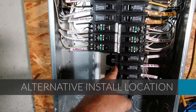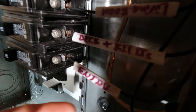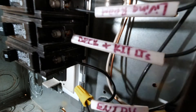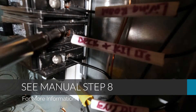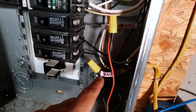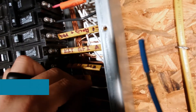If you need to, this is an example of an empty location in your breaker panel where you can install new breakers to power the sensor. In my panel, I decided to go with the recommended method to use two existing breakers. To do this, I had to remove the existing wiring from the breaker and add in that additional piece of wiring, then connect one of the power legs from the sensor to both the small piece of wire coming out of the breaker and the original circuit that was in the breaker before. You see here I wired in the two pieces of wire, wire-nutted them together, and then sent those out to the two existing points of the breaker, and then wired in the harness that comes with the system.